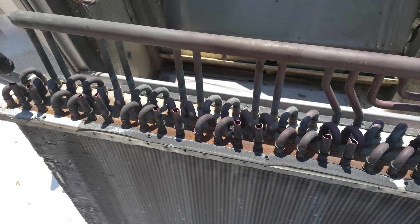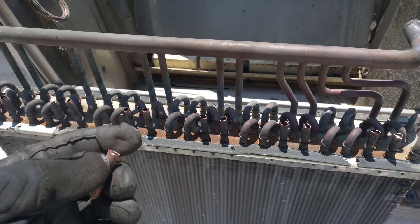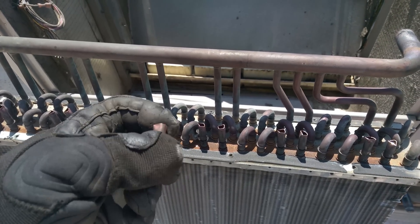I'm just going to put feeding tubes in here. These just got to be opened up just like they are, then I put the tube in there, kind of crimp it around a little bit, and then just sweat them over — silver solder them.